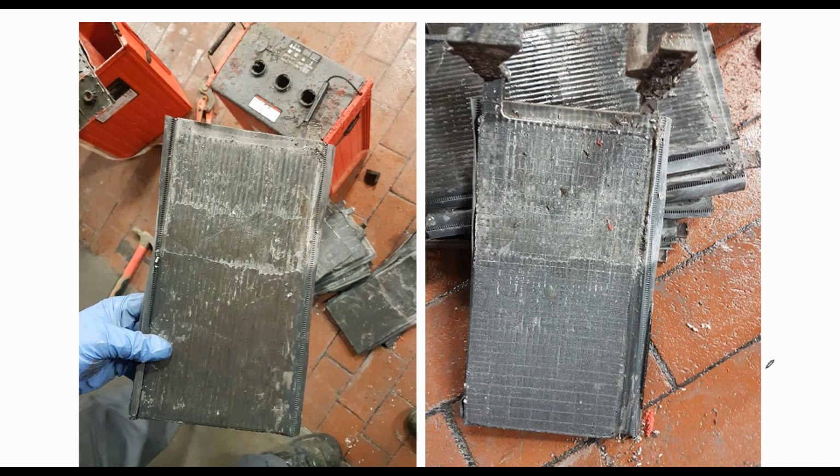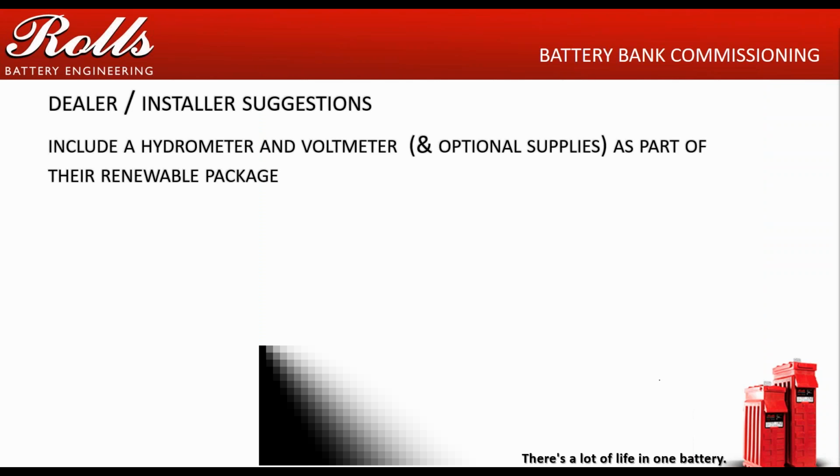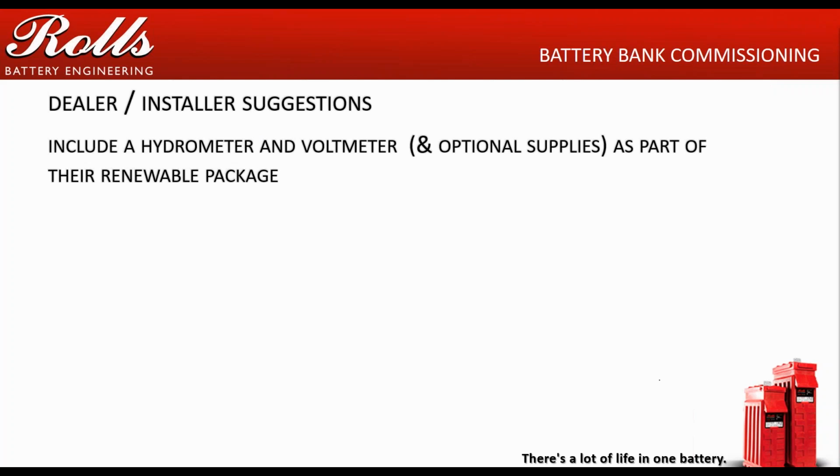All right. Now, some suggestions for dealers and installers. First, the most important suggestion for dealers and installers, and if you're an end user and you don't have one, get one: get a hydrometer, get a voltmeter. It could be a hydrometer or a refractometer, and then a voltmeter. That is the minimal set of tools you should always have at the site. You use the hydrometer to check your specific gravities, and the voltmeter to check your voltages at terminals, at cables, or at inverters. Those are important things to have when troubleshooting or maintaining your system.